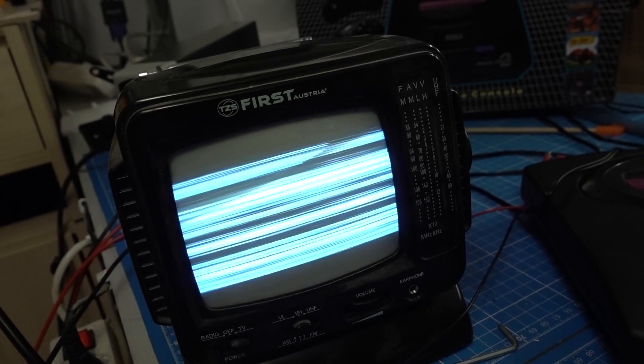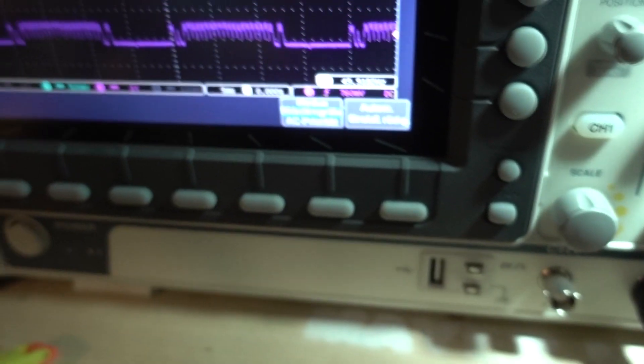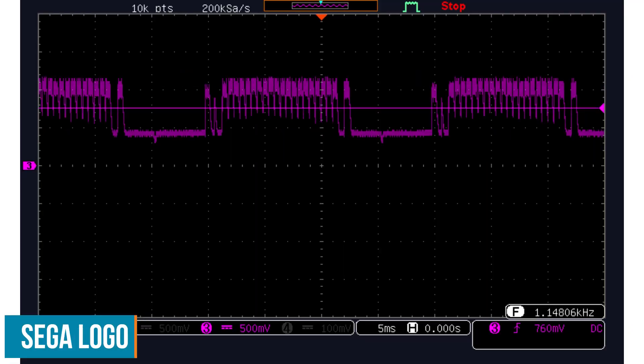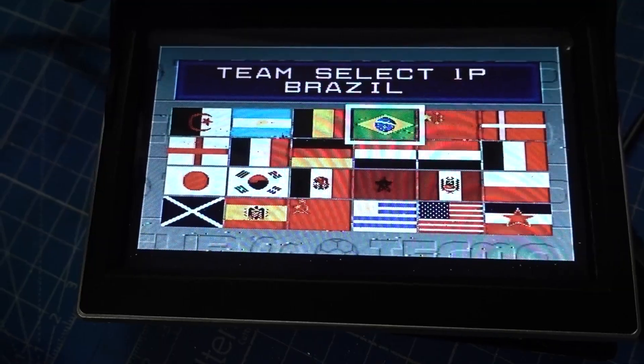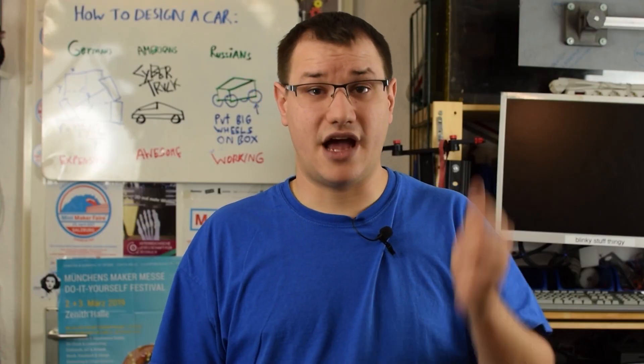Keep in mind that if you do such things, pinouts may be scrambled in weird ways — which they are on this unit. So don't assume it's the same pinout as the fake knockoff you may get; they can be vastly different. Before taking everything apart I verified it works first. I hooked it up to a tiny TV — no picture, but the sound was working, so I knew the unit had booted. I used my oscilloscope to verify there is a composite signal, and yes there is. I then used a tiny rear-view monitor as the screen, hooked that up, and it worked perfectly.